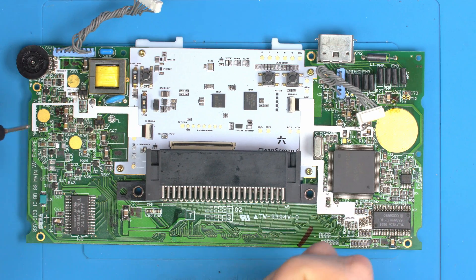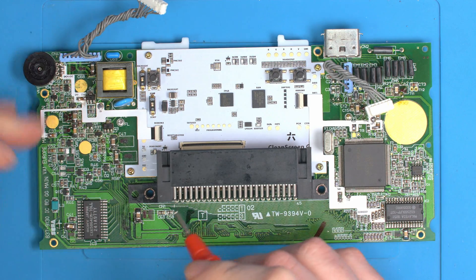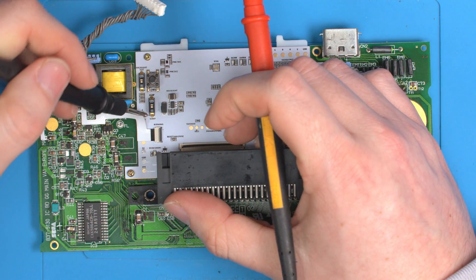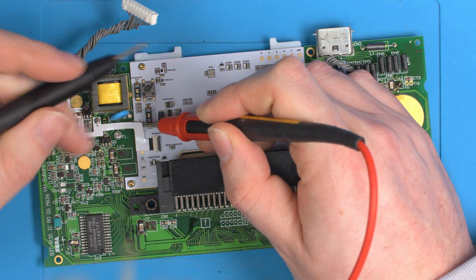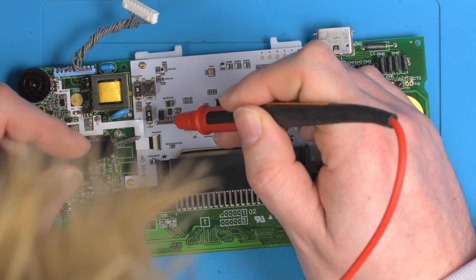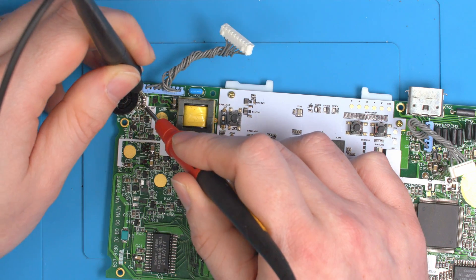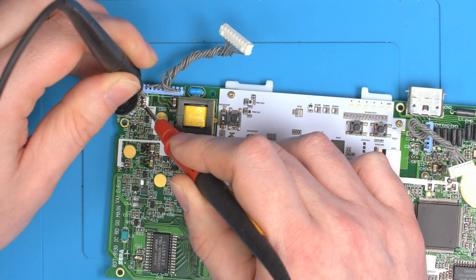With everything installed, do a quick continuity test on the exposed pins. We've got pad 2 here — it should go to pin 2 underneath, and lifting slightly you can get your testers in there. Go pad 2 to pad 2 — continuity. Start just below it goes to start. For the wheel, go over the two pins all the way down — at the bottom end it should beep because of the resistance, getting to less than 50 ohms.